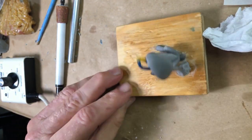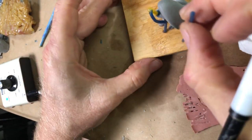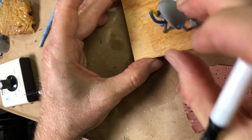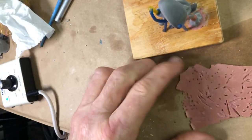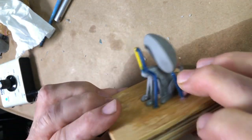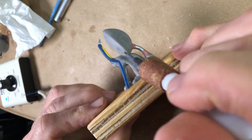One last job is to put in a vent that will let the air out of the head. That's basically the most important principle in casting: the resin has to flow in, and in order for it to flow in, the air that's down in the mold has to flow out. The resin will not push the air out of the way. Air is amazing stuff.